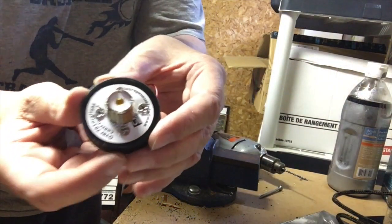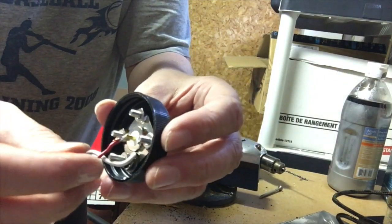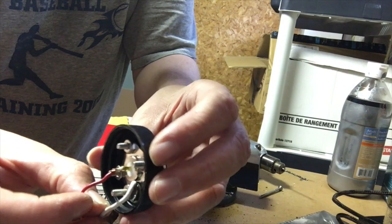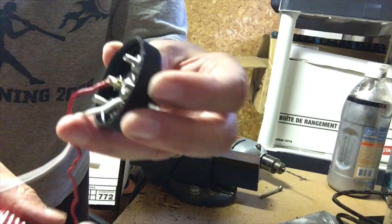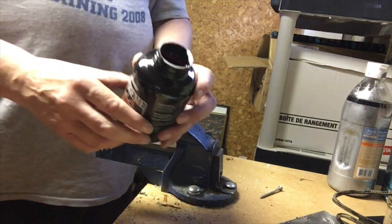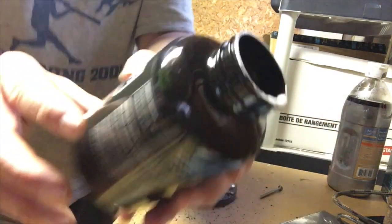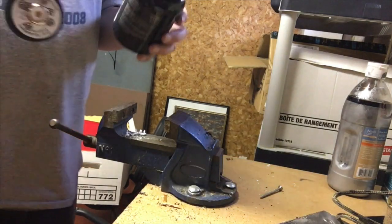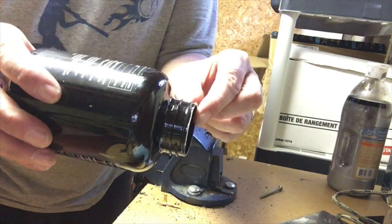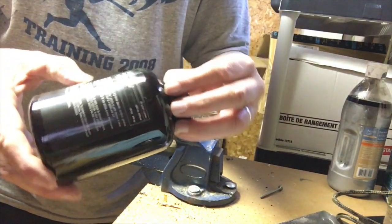Next step. You can see now I've screwed the SO239 onto the top and I've got it in the right way, just screwed it on the back. There's the one going to the vertical part, there's my ground — the white wire — and I've just put it on another screw. Soldered them in place to hold them and get a good electrical connection, hopefully. Now we're in business. The lid screws on top but that's no good, because if I'm screwing on my balun lid then all my wires are going to get twisted inside and I don't want that. So I'm just going to take a saw and cut the grooves off so that the cap will actually sit on it. Then I'm going to tape the whole thing up to hold it all together.